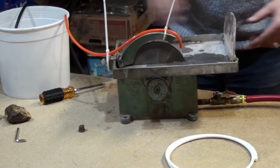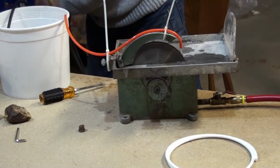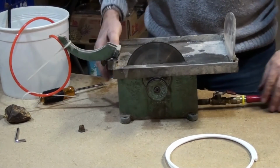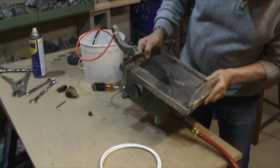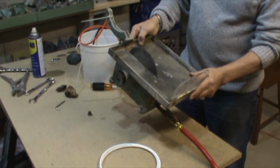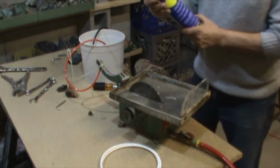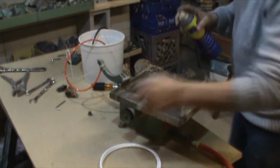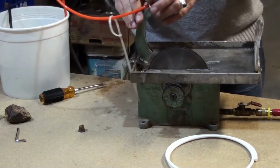So what you do is you just stop cutting, make sure that everything is going away and all the water is gonna go down. Once you finish with that, make sure to clean your blade, okay? So if I go like this, I'll dump this one to the side, make sure it's all gone. And so everything goes down right into the, there you go, I'll have all the water below the surface. And like I said before, a bit of WD-40 on the blade. That will help. You could do it on both sides. Okay, that will help it. So this is a very simple way of doing it, right?